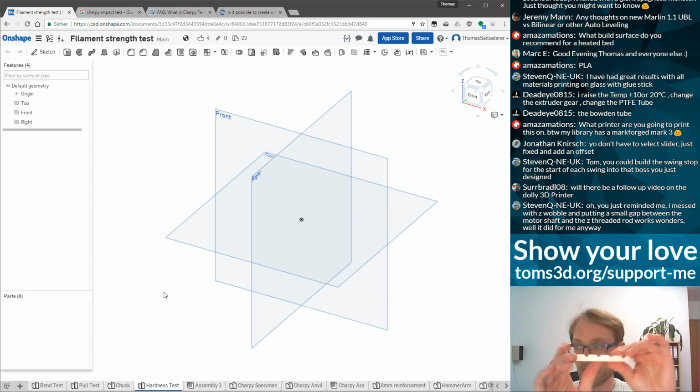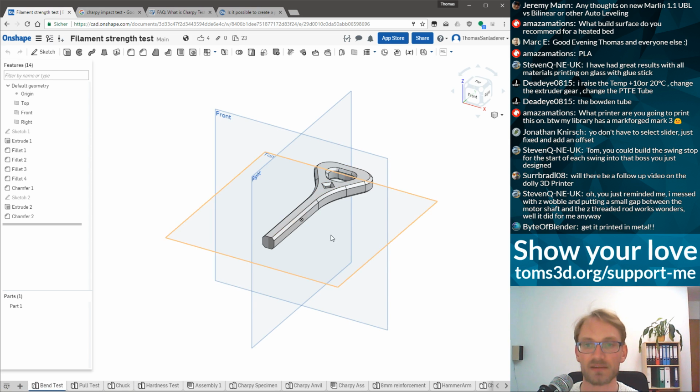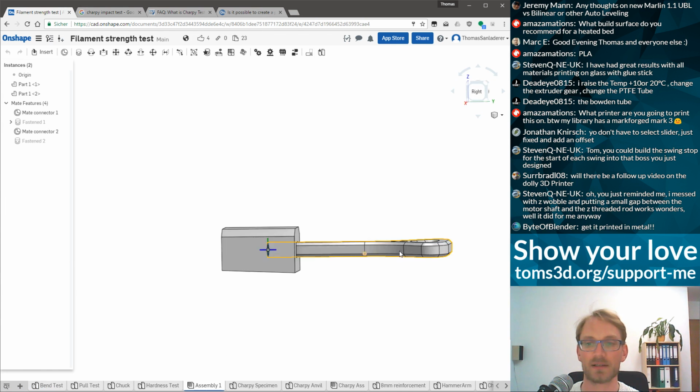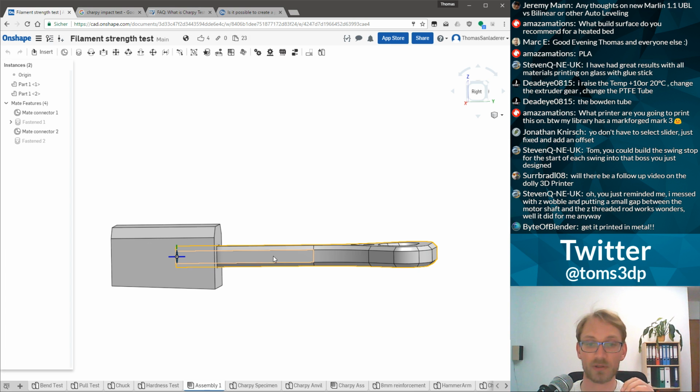But yeah, some materials are more flexible than others, as in softer. So what I used to do, I don't have one here, but I can show you. I have the bend test. I used to just put this in the chuck like that, and pull down with about a 1 kilogram load and see how far this side bends down.